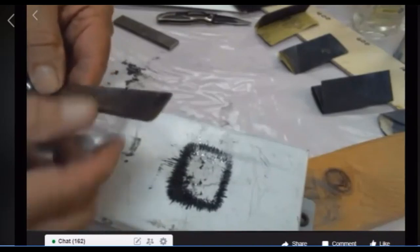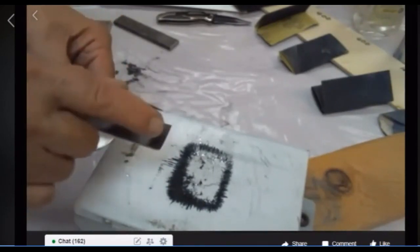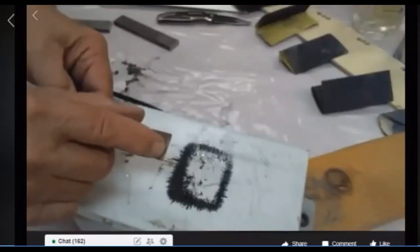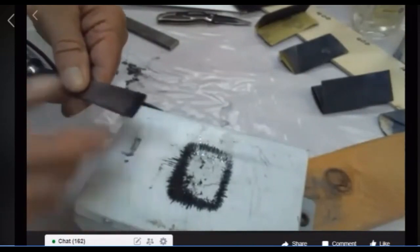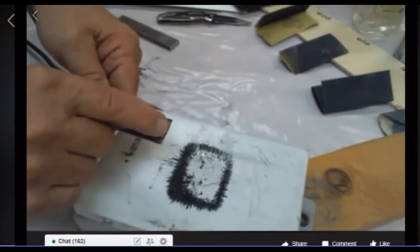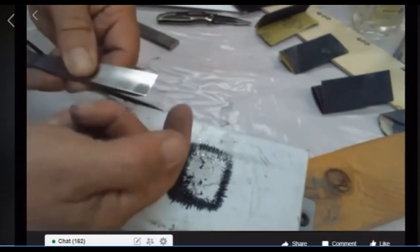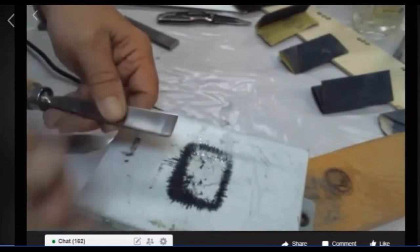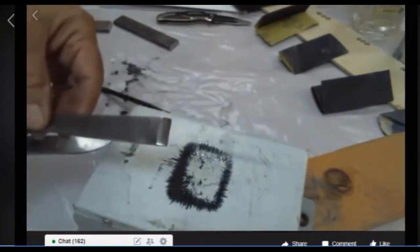So here's how magnetized tools will dull fast: all these metal shavings are hard steel that you just took off the workpiece. The magnetic flux lines are densest right at the sharp cutting edges. When you wipe the tool off, those microscopic particles cling to that edge. When you go to cut a piece of wood, that little loose piece of steel jams right into that microscopic edge and makes a nick — and it starts dulling the tool down immediately.